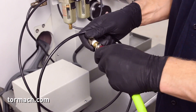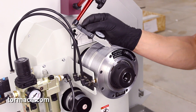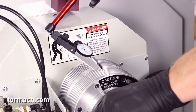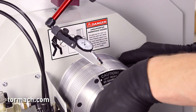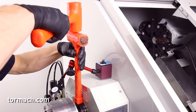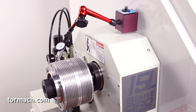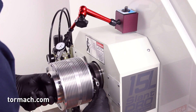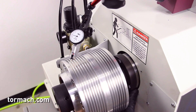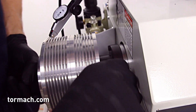The quick connect can then be connected to the air compressor. Aligning the automatic collet closer kit with the 15L SLANT-PRO spindle. Put the base of a magnetic dial indicator on the top of the belt guard cover. Make sure that the dial indicator contacts the aluminum of the pneumatic cylinder furthest away from the belt guard cover. Rotate the spindle clockwise until the needle reaches the highest point on the dial indicator. Use a pair of dead blow hammers to gently tap the mounting flange. Rotate the spindle again until the needle reaches the highest point and repeat the tap on the flange. If you see no effect on the dial indicator after striking the flange, loosen the screws slightly. Continue these steps until the measured runout is less than two thousandths of an inch. Tighten the four M6 hex screws with a 10 millimeter hex wrench.